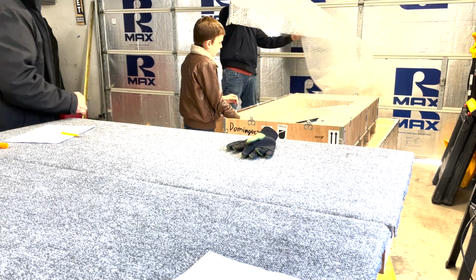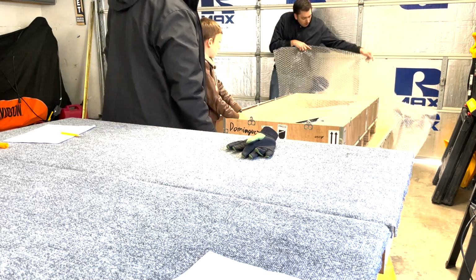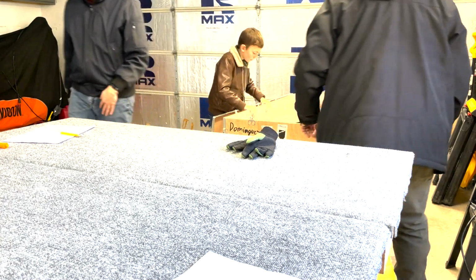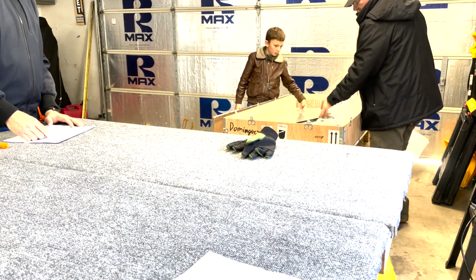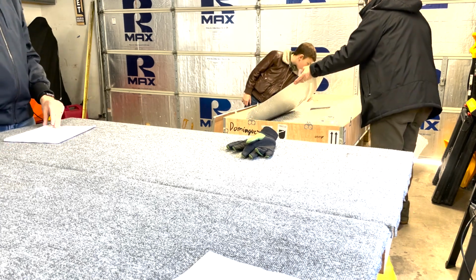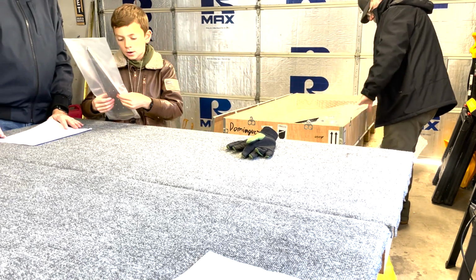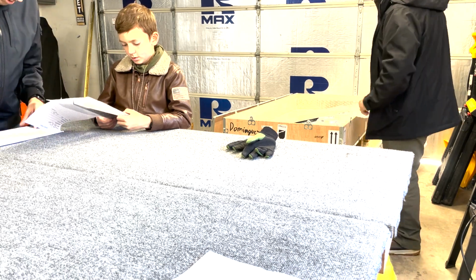Surprisingly, it only took us about 3 to 4 hours to complete the inventory of the empennage kit. The kit's very well organized and very well packed. We were disappointed to discover during the inventory that our dimple die set was on back order. That's a very important tool that's included in the empennage kit. It allows you to dimple the ribs and the skins to accept the countersunk rivets.